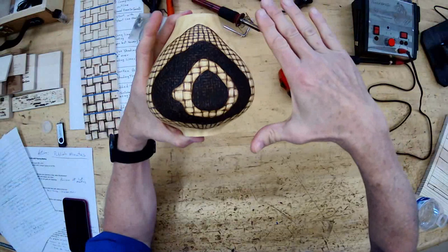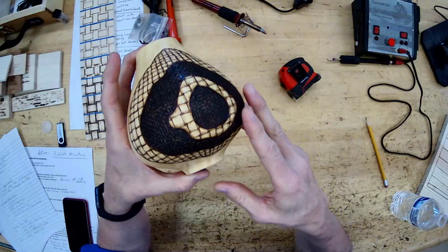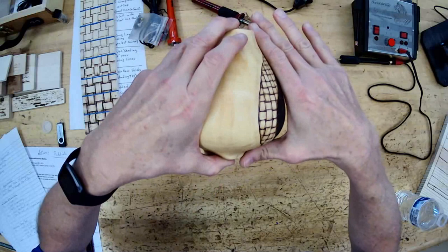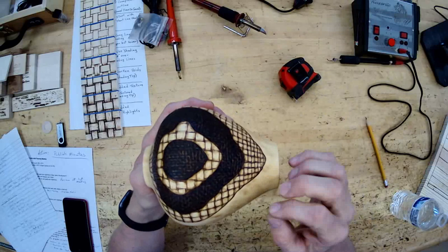So I had a piece of wood that was shaped like this, and it went up right tight. I would index the vessel, draw the line, laying it on the table, just kind of like Pete does with his basket illusion. Then I would rotate it and keep drawing the lines. When I did the horizontal lines, it was obvious: I just put the pencil on the tool rest.